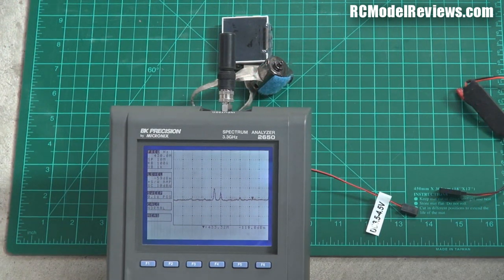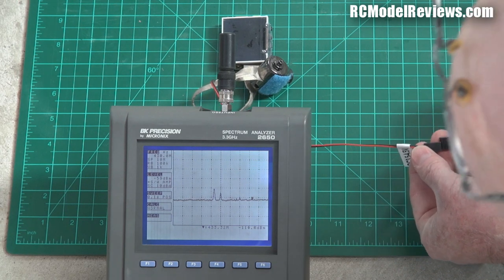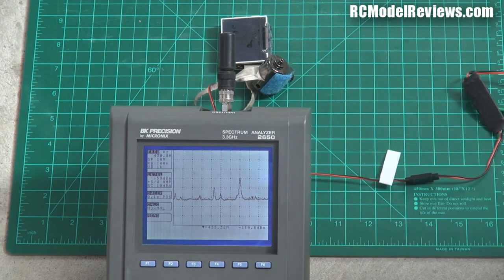Now it's time to test the Horizon HD camera — I've tested the emissions from this before, but we're going to do a direct comparison with the BossCam. Currently we've got minus 111 dB of background noise. Let's plug this in and wait for it to boot up. Whoa — that certainly produced an increase. And then when the screen kicks in, it's way up there: minus 83 dB. So that's a huge increase in the noise floor, and a lot of that's coming from the screen. Remember the BossCam doesn't have a screen. If you just want something out of the bag, the BossCam has a whole lot less noise on UHF.